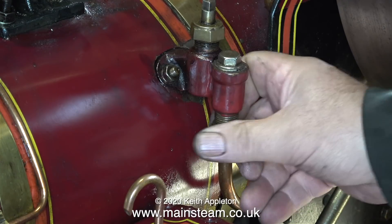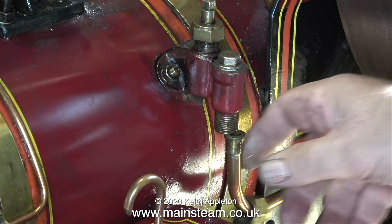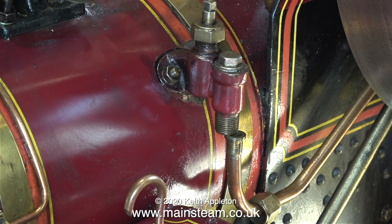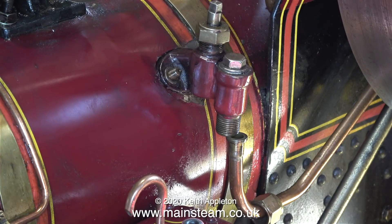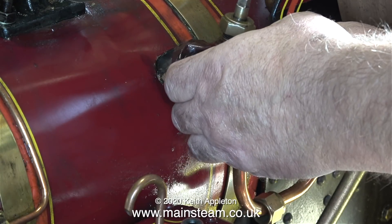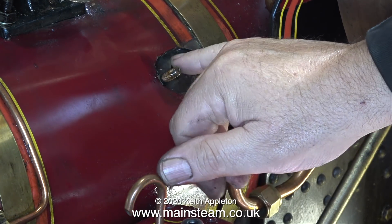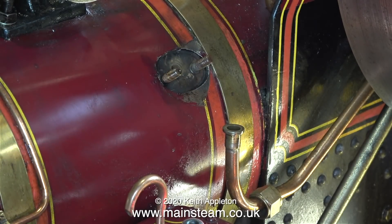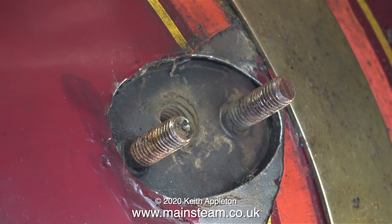This check valve leaks — not the valve itself, it's leaking where it's mounted to the boiler. I've had a few problems like this because it's a copper boiler and the studs holding things like the cylinder, the motion bracket, and these check valves are made from phosphor bronze. With the constant contraction and expansion of the boiler, after a while you just need to tighten the nuts slightly. The nuts on this check valve were particularly slack. This check valve takes water from the crankshaft-driven pump and feeds it into the boiler, so it's constantly expanding and contracting with the cold water from the bunker tank. When the engine was in steam there was a constant frying noise, because oil from the motion ran down onto the check valve and the leaking steam made it sizzle.